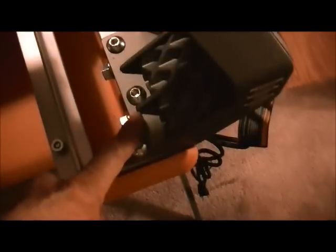There are 3 bolts and spacers that go in the top of here. There's one here, here, and here. Spacers go inside the holes of this guard, this aluminum guard here, rail rather, and at the bottom there are opposing nuts, and, well, you can't see it now because I have the pan there, but then you have 2 other ones, so there's 5 altogether. There's 2 other bolts with the same washers and then the same nuts, so you can see the nuts here. That's all there is to getting this arm attached to the frame.